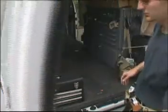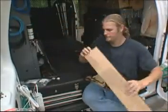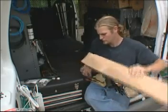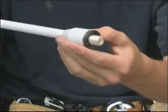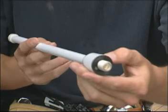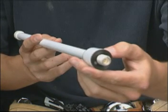There are two basic types of antennas available: omnidirectional and directional. Omnidirectional antennas radiate spherically, providing equal coverage in all directions. They are best suited for multi-point links and are typically used at all forwarding sites. Because they receive and transmit signals in all directions, they are the preferred solution for most installations.